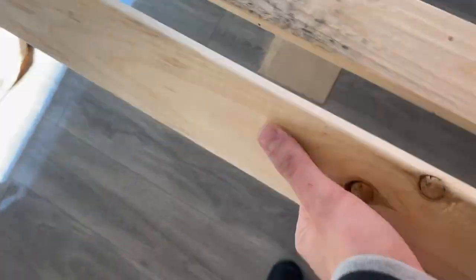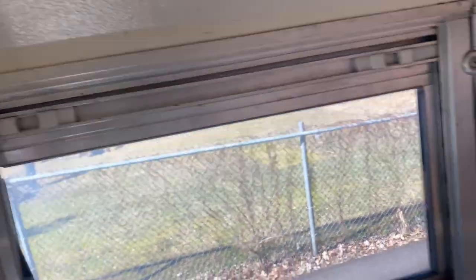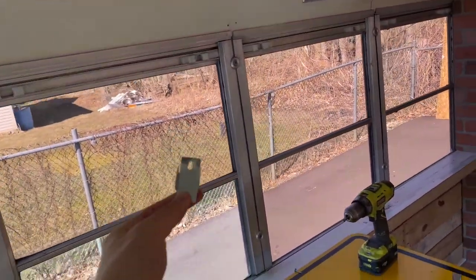So right here I cut two planks — I'm gonna put a piece of wood along the whole side right there, then put the curtains on it, because you can only mount one screw right here where the bracket is and you can see how it's bent because there's not a good spot. So I'm gonna put the wood first and then put the curtains. Took off the hoodies — it was too hot in here at 30 degrees outside, go figure. But the curtains are finally done, all hooked up. Took me a while because there's a fat metal beam going right where I needed to hang that piece of wood, so I had to work around that a bit.